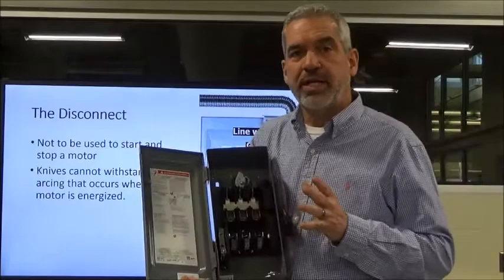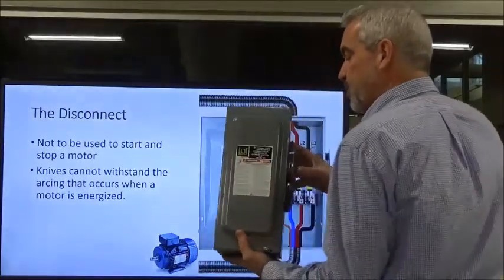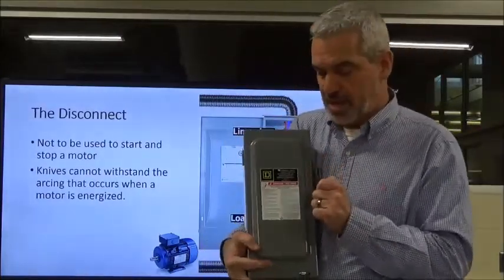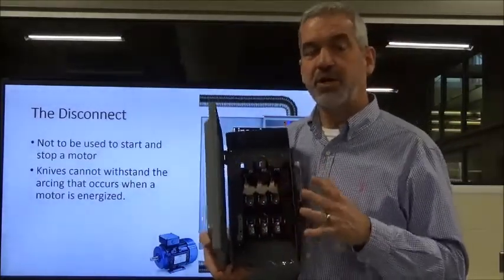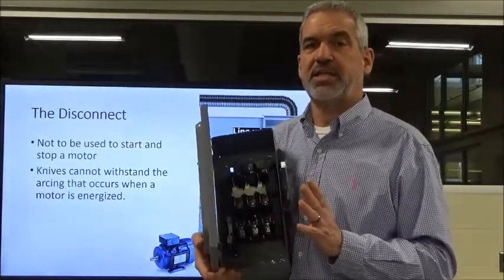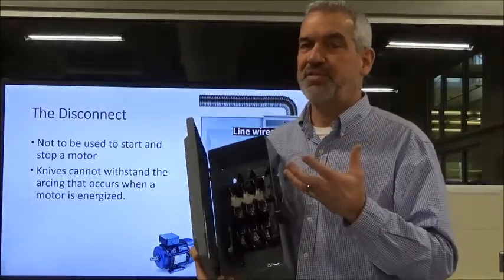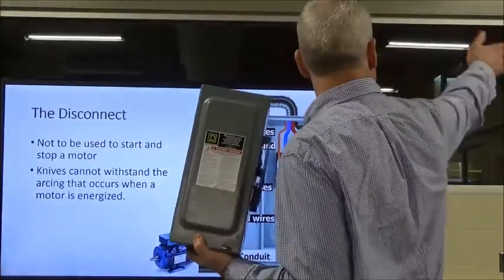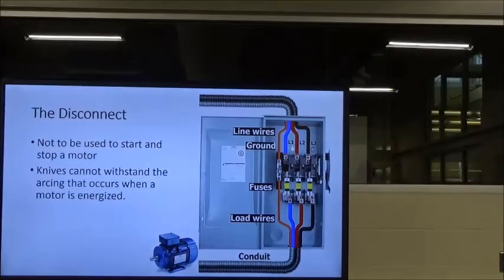Now, whenever you are engaging or disengaging a 3-phase disconnect, or any disconnect for that matter, you'll always want to stand to the right of it before you do that, okay? There's a reason, and I'm going to show you why in just a little while when we talk about short circuits, okay? What can happen is you can accidentally have a short in between your phases, and it will blow the door off of this thing, and it can hurt you very badly. So regardless of how safe you think it is, whenever you're energizing a disconnect, always stand to the right-hand side and get it out of your line of vision, okay? You should be wearing safety glasses, but safety glasses don't stand a chance in a head-on arc flash. So always stand to the side and take your line of vision out of the path before you energize that disconnect, okay?